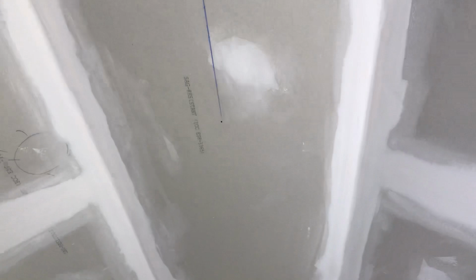What I like to do is start it off in reverse, just to break through the paper. A lot of times you can go in reverse and go right through sheetrock. If you put it in forward and you punch it, you'll torque the drill, you know what I mean? And then you'll damage the sheetrock. So we want to go nice and slow with the bit, okay?